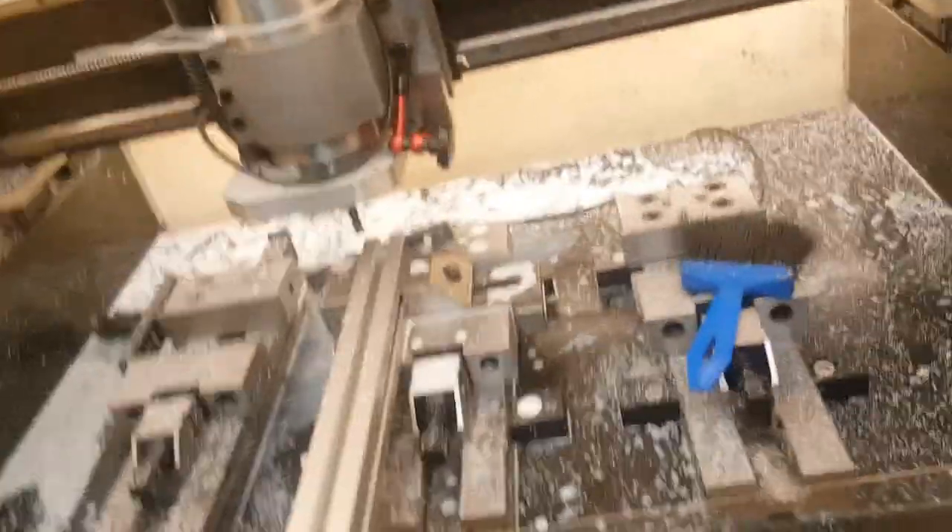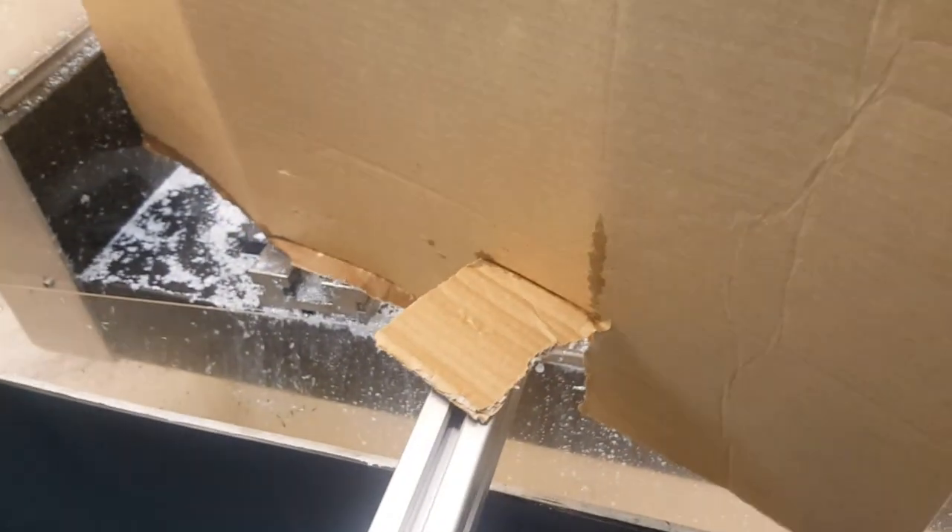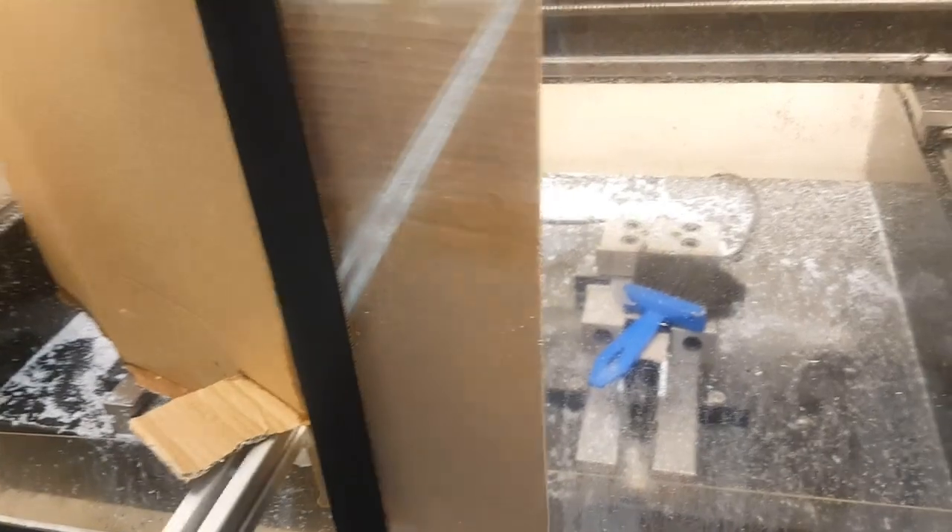That parallel seems to be making it all reasonably leveled. And because I can't close the machine, I can't use really flood cooling, so I'm using that cardboard with the cutout in here, and then I'm closing the door so the chips are not flying all over the place.